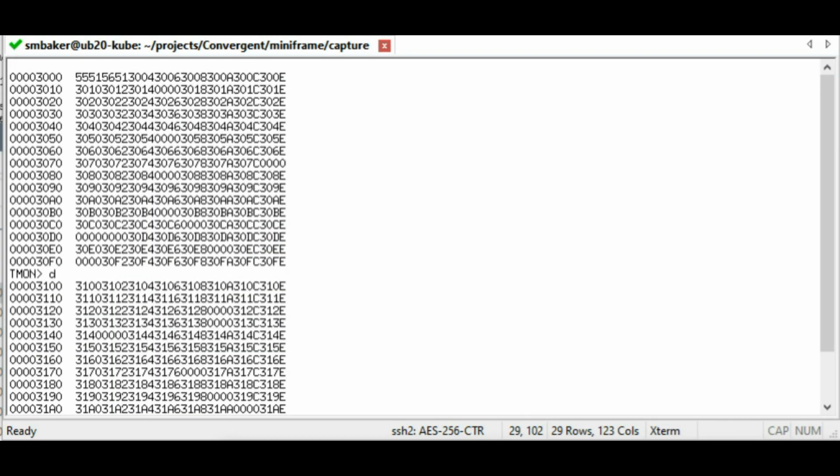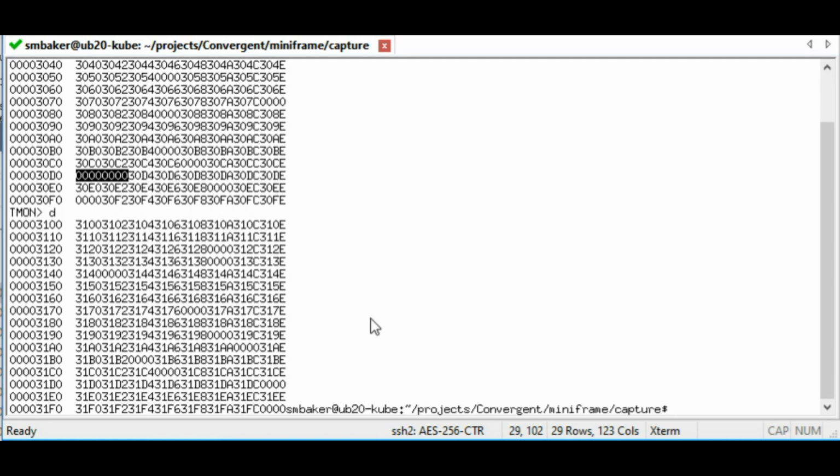So here's what it looks like after replacing those LS461s. This is loading the boot sector. Recall that this should just spew out numbers straight across. Previously we had that problem where they were showing up in the wrong row. But now everything is in the right row in memory, but we've got these weird holes occasionally appearing. There's one hole. Here's another hole. Down here are 2 adjacent holes. And every time I run this, they show up in different places, sometimes more holes than others.